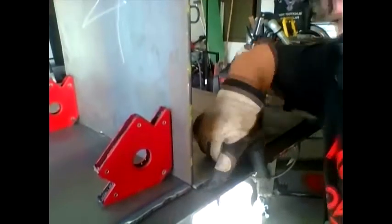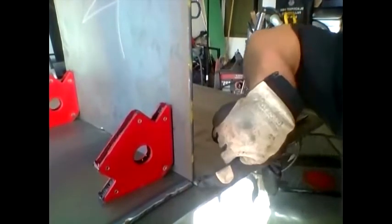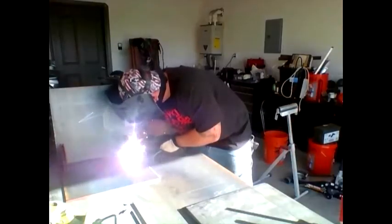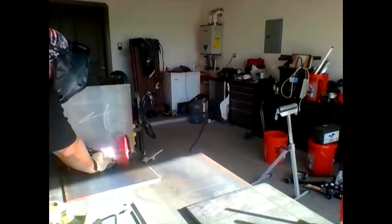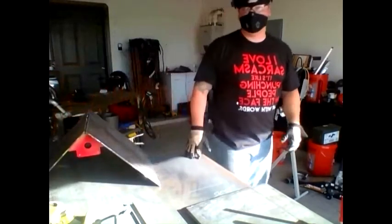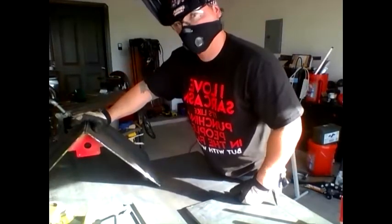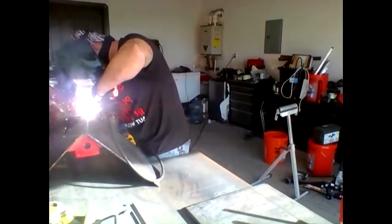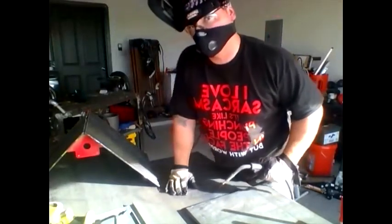You see what I did here? These two are the plates that I'm gonna weld together. This plate here is holding this one up, so there's gonna be a quarter inch gap. Only the corners of these two plates are touching. Now I'm gonna do what's called a fillet weld. I'm gonna fill up that whole crease. Make sure it's sealed up nice and tight to keep the heat inside. I'm gonna try to do it in little bitty sections to avoid as much warpage as possible.